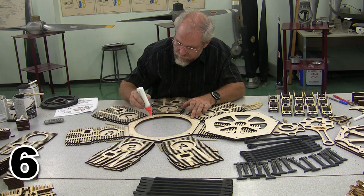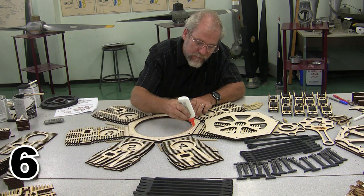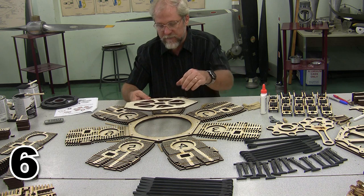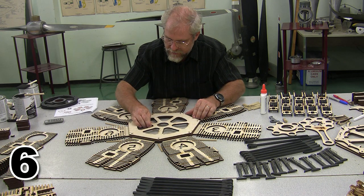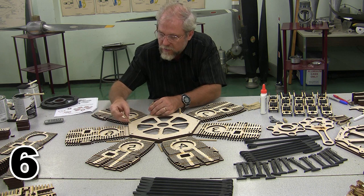And this one you can't put too much glue on. Well, you can, but it can take more glue, so I'm going to put a little more glue on it with two full rings of glue. And once again, keeping my grain in the same direction as my cylinder number one, I'm going to go ahead and slide that up into this place and pop my locator pins in position.